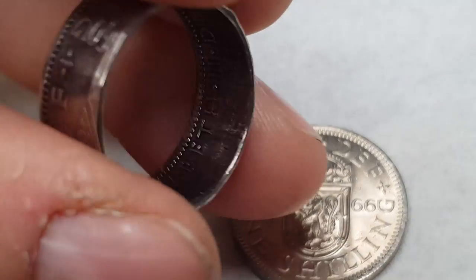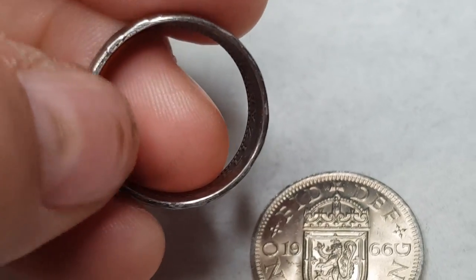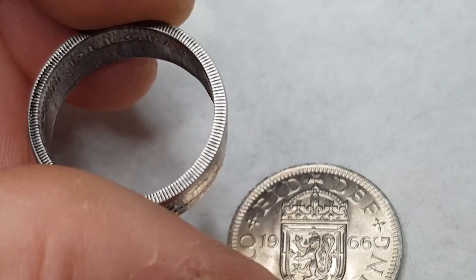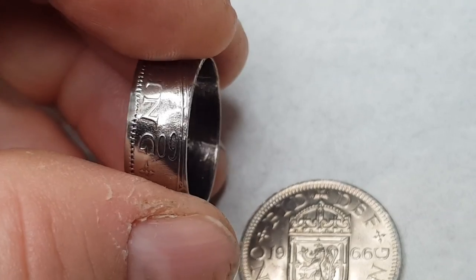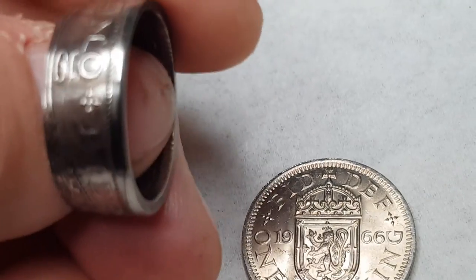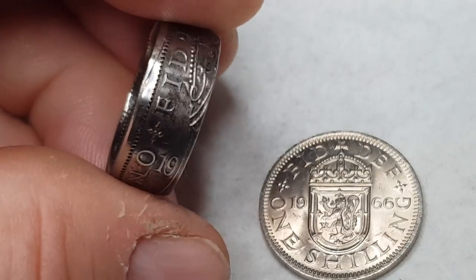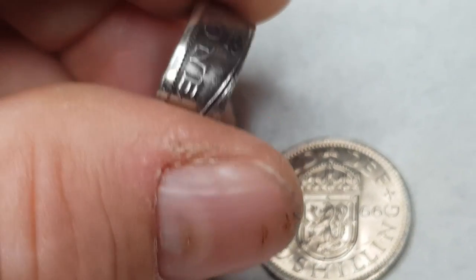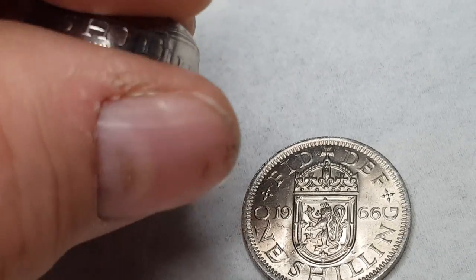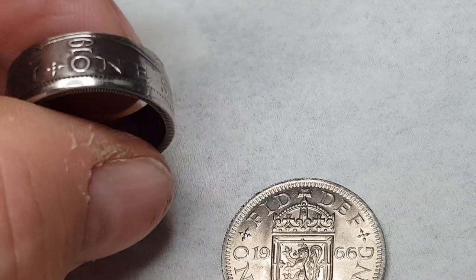It's been cleaned and put in a ceramic lacquer — one that I got from America. Unlike acrylic lacquers, it kind of dries with a glass-like finish and takes a fair bit of time to wear off. It will wear off, but it will last longer than most of the lacquers. The other option is to powder coat it, which works, but I think it takes away a little, because it just ends up completely smooth when you powder coat it — it takes away that three-dimensional feel from it. It just looks like it's kind of printed.